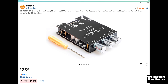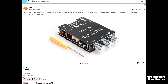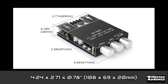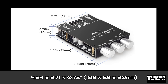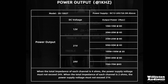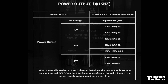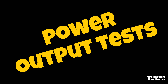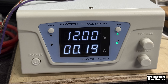There are different brands — the Wuzhi (WZHI) are the ones most people want; mine is Gangazoo. Dimensions are very compact at 4.24 by 2.71 by 0.78 inches. The TPA-3116 chip is nothing new to me — I've tested several of these in what I call the Chinese mini-amp invasion. I'll leave links to those playlists below. We're going to start with some tests here at 12 volts to find out what this amplifier can actually put out.